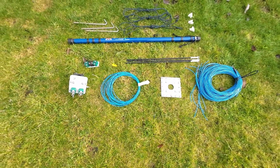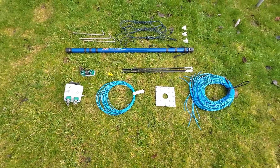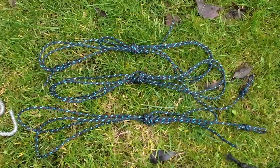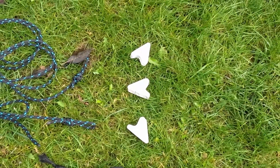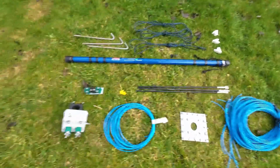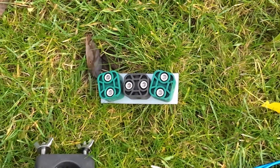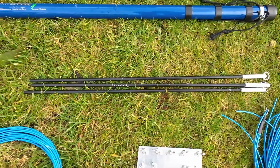Fast forward a week or two, and here are all the bits and pieces we're going to use to build this antenna. I urge you to use your imagination and use what you have to hand. We've got some tent stakes made from rebar - galvanized - we need three of those. We've got three guy lines, this is Mastrant P, four millimeter. We've got three clam cleats to make the pole straight and tension the guy wires. We've got our six meter pole - this is the Life's a Breeze Pro pole. And coming down, I call this the top clamping plate, which goes on top of the antenna. The black one goes onto the mast and the two green ones are for the fiberglass poles. We've got three fiberglass poles: two used at the top and one at the bottom.